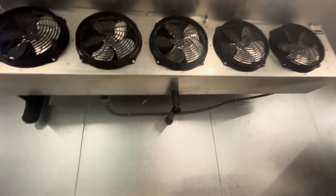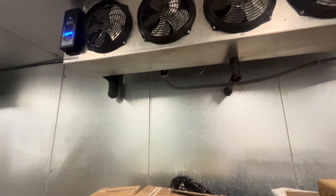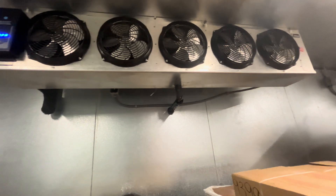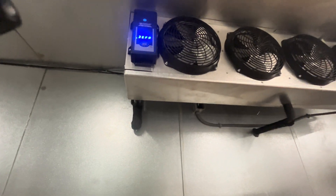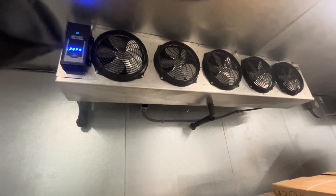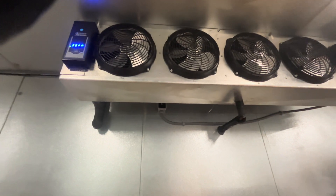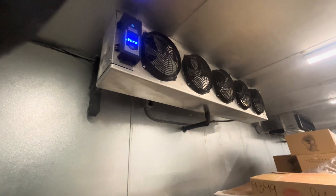So most of the coil is defrosted. I've been watching these motors, and honestly, the way it seems to be happening is that whichever side has the most ice at the time, one of the motors doesn't work — or it will do some funny stuff. So I'm not changing any of these motors out until I troubleshoot that a little bit further. Because the controller goes through a check, a sub-check for startup, and it checks the fans. Every fan runs just fine. If there was an issue with these motors and communication and the fan delay and whatever, it wouldn't pass that checkpoint. So I just think it has something to do with the ice blocking the airflow and messing with the ECM two-speed. I could be wrong, but I'm going to find out.